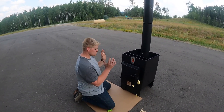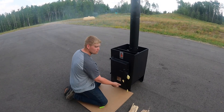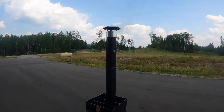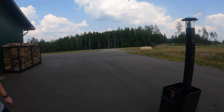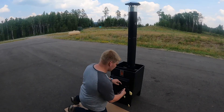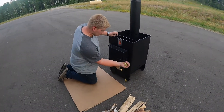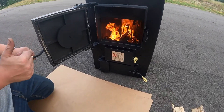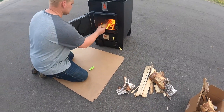Check on it periodically as you're watching your stove. If it's going really good, go ahead and turn your draft control lever to about medium. It's been about five minutes. As you can see, the smoke has pretty much dissipated, so you're burning at a higher temperature. We're going to open the door — obviously entering oxygen into the fire chamber will make it get a little dark — but you can see your fire is burning nice and hot. Then put the rest of your wood pile in.